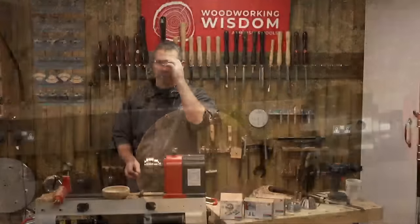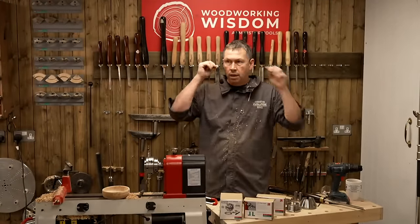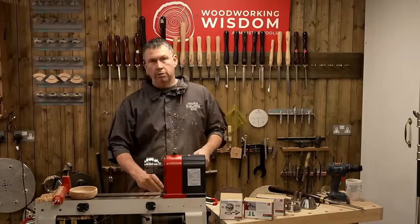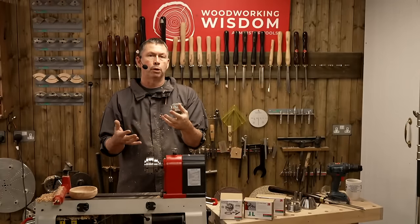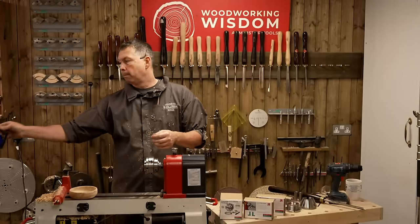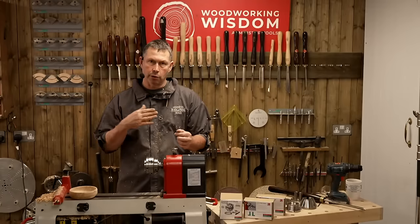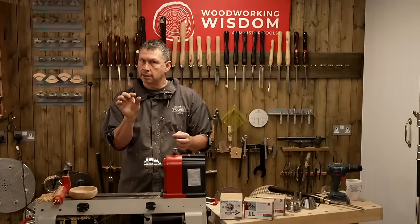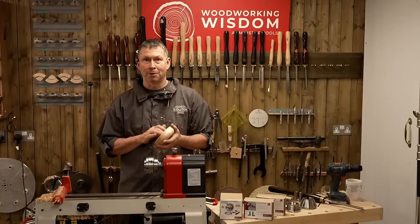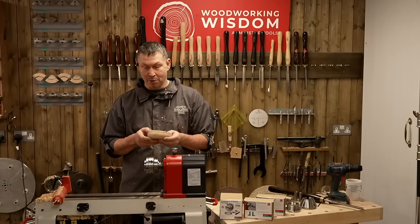Angling Coach has asked: does the noise of the cut help you determine the depth? It definitely does. As my turning career has developed, I find now — especially when bowl turning — that I need to wear ear protection a lot more. If I was doing a bigger piece, they would be on. But you're dead right: as you go through and get closer to the centre, you can hear differences in thickness from the side to the very middle. It's a heart-stopping moment when you start hearing the tininess as it gets really, really thin on the bottom. You will pick that up.